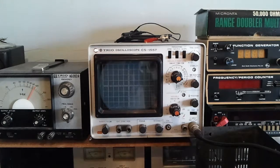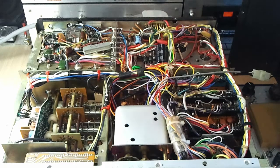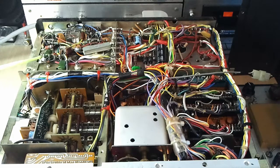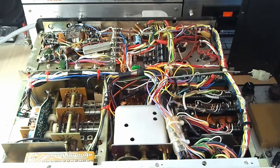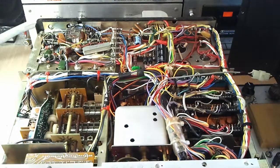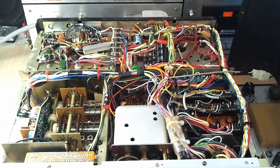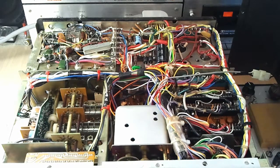I'll show you what's been done between the last video and this to prove that it isn't an ALC problem. The first thing I found when looking for the ALC problem was that this inductor up here was in fact disconnected at that point, and that's one of the inductors that the ALC line feeds through. So I thought that'll stop ALC from getting through, but at that stage I didn't know we weren't getting to the point of developing ALC. This transistor is the ALC amplifier transistor, and I've taken it out and tested it — I've even had another transistor in there — and still no ALC.